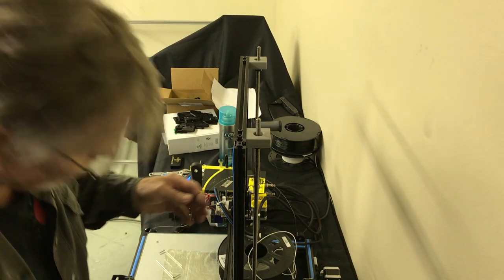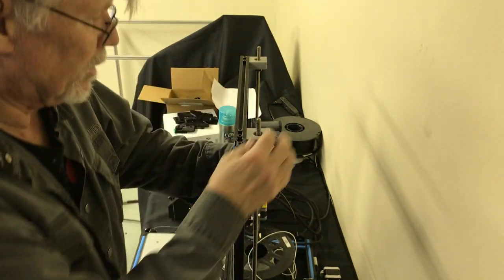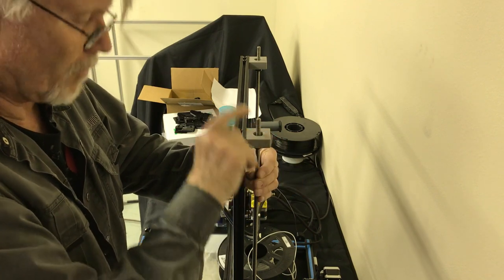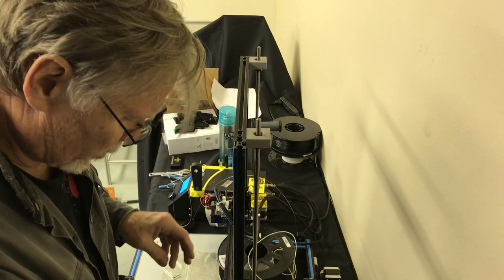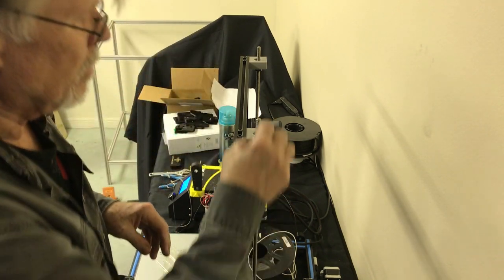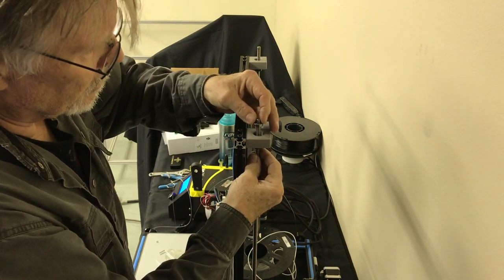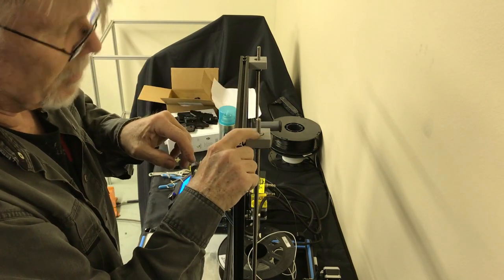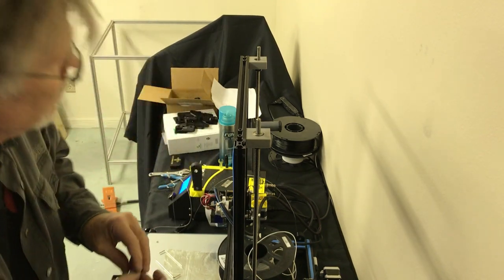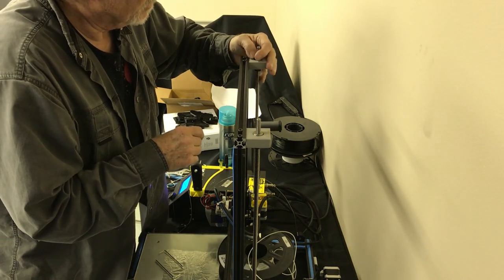Okay, next. What's going to lock this into place is the bearing over the top of this, and the flange holds this from going one way or the other. So what our objective is here, when we put the bearings on, of course the flange sticks up. It's going to be tight, okay? Bearing flange against the bearing block. Same thing over here. Don't you love it when our flange comes together?